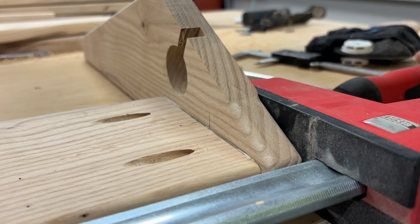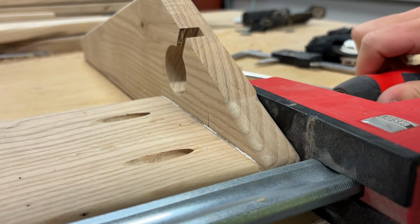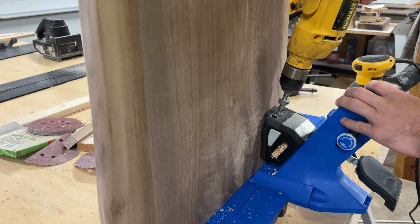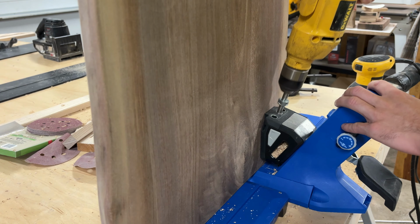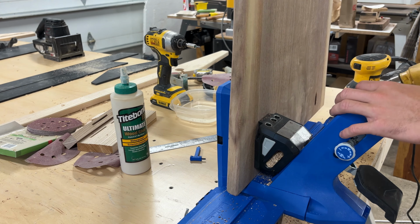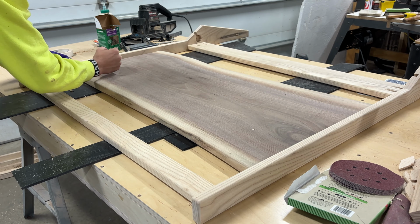So I decided to just use some simple pocket hole joinery that would all be hidden anyways, and then use some biscuits for alignment. This method, paired with a little bit of Titebond, really was simple and gave me a clean and strong joint between each piece. I used the same technique when putting the headboard together, and it was finally looking more like a bed.